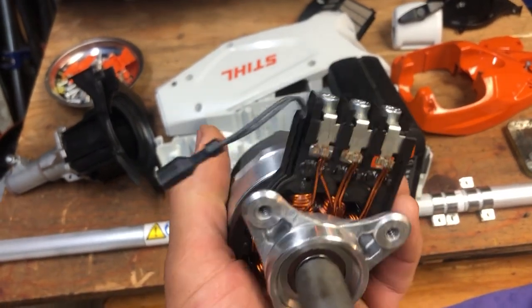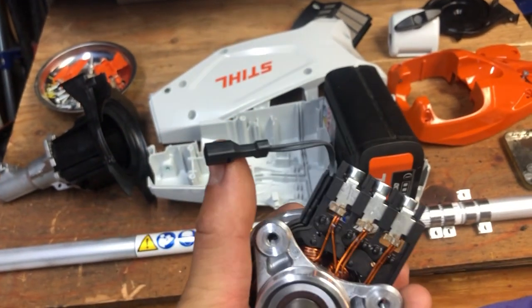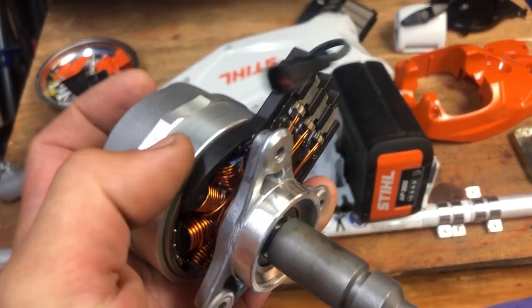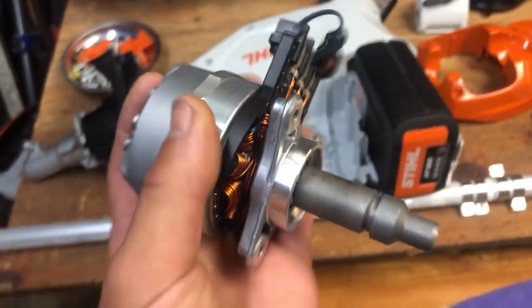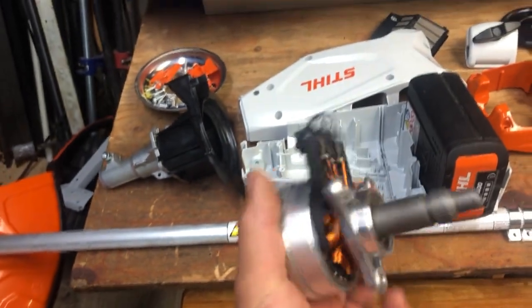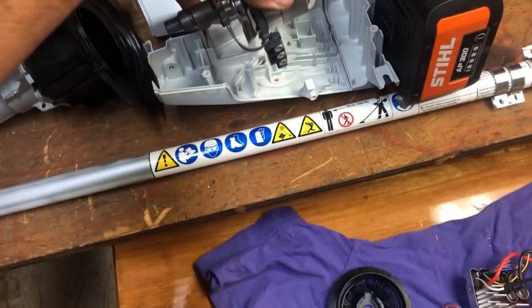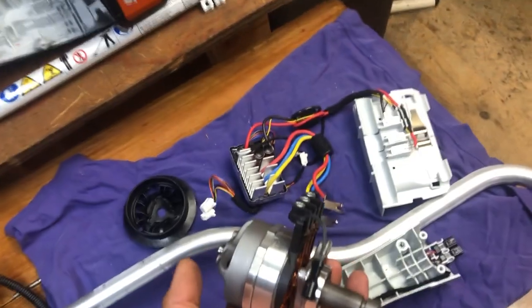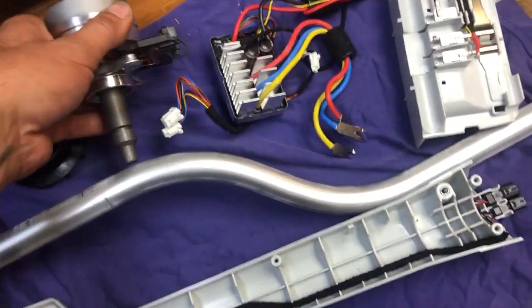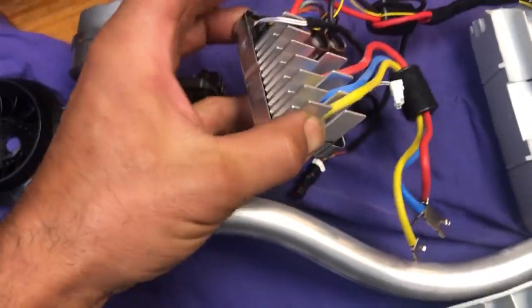There's a pretty decent amount of battery wire. The two-wire connector here runs down to that blue dab — I'm guessing it's a temp sensor. There don't seem to be any halls; this is not a precision speed device, so they're surely just running it sensorless. The big demand on this is going to be current through the phase windings, so here we have substantial phase wires and a fair bit of heat sinking on the speed controller, on the motor controller.